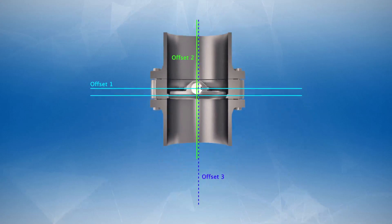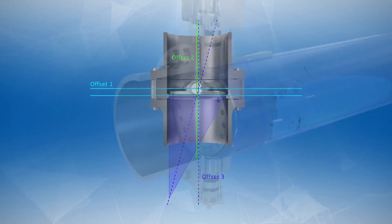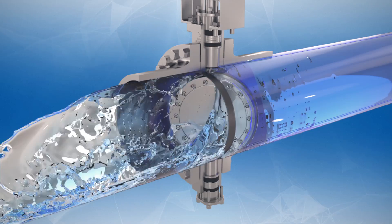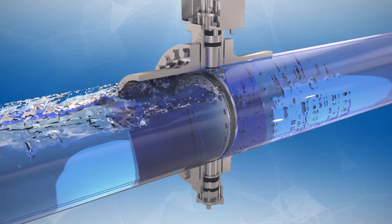The third offset is related to the sealing components that are machined into offset conical profiles. These three offsets ensure friction-free stroking. Contact is made only at the final closing position. As such, the valve is set on torque, providing tight shutoff.